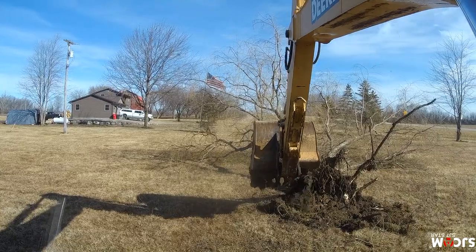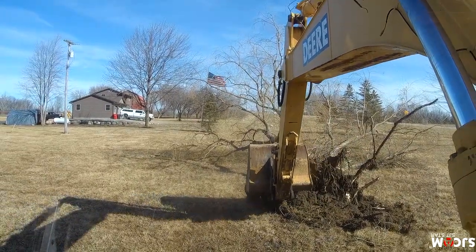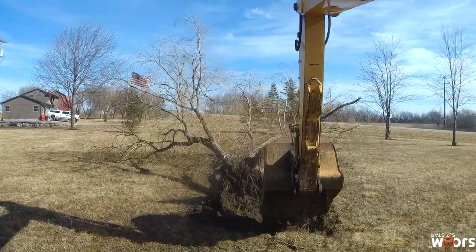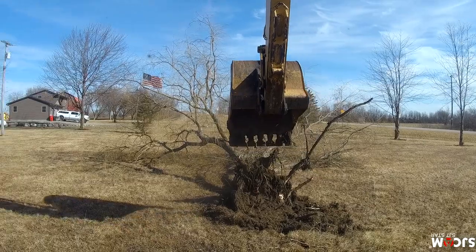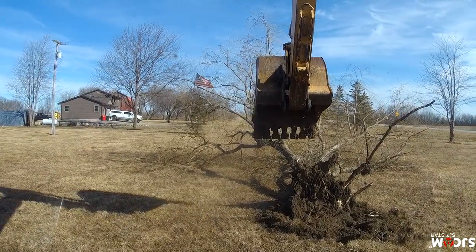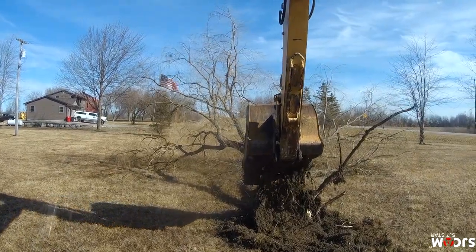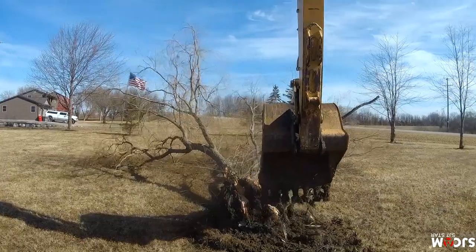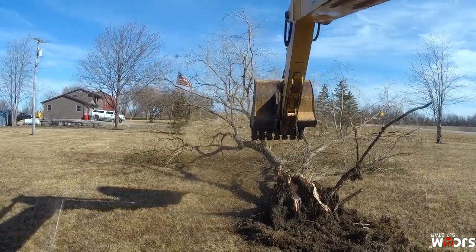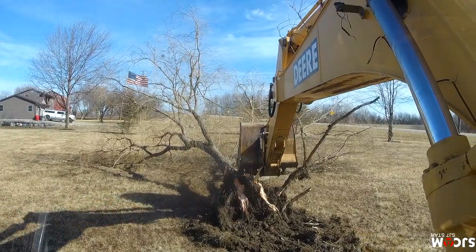What they do is, when you max out the pressure to the track, it's supposed to let it go somewhere, right? It's supposed to let it go into the return line. But I've heard people say it can go to the case drain as well. I've never been into one of these before, so I looked around, and I think I called the equipment distributor, and they wanted like $300.